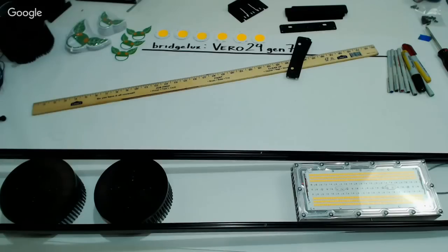And why all of a sudden Vero? Well, I like to keep an open mind about things. The cost is about 35% less than Cree, and they're very good. You can achieve potentially a little higher efficiency with the Cree if you run them real soft. They perform really well down at those low drive currents. But, you know, not everybody's into that.